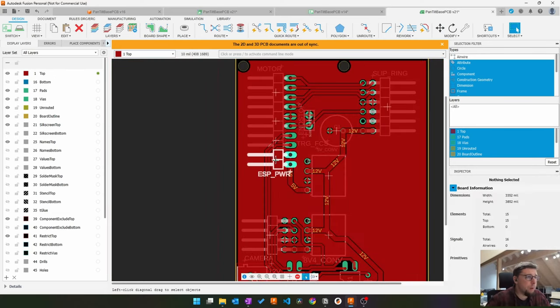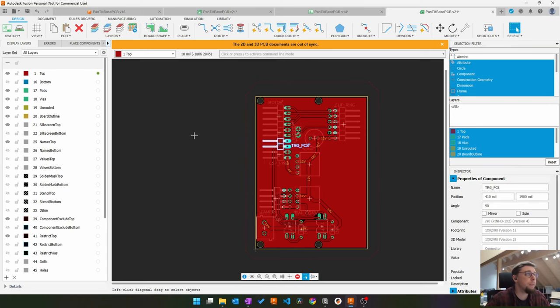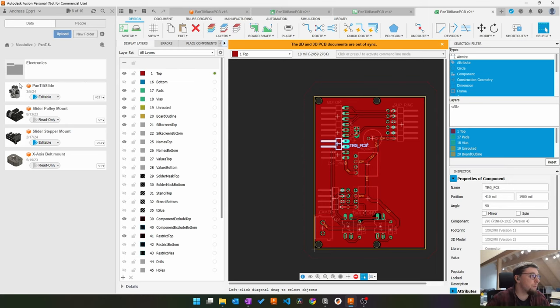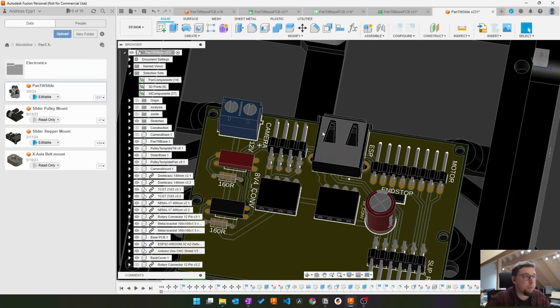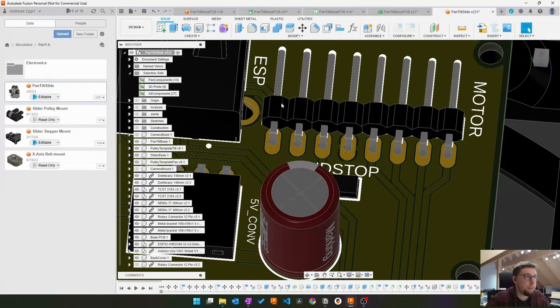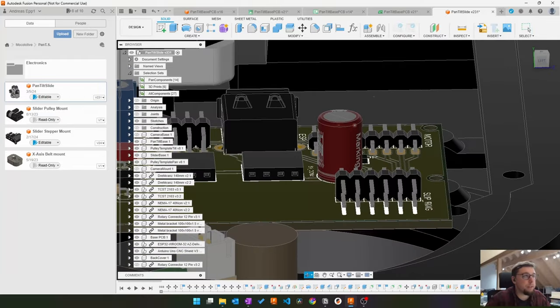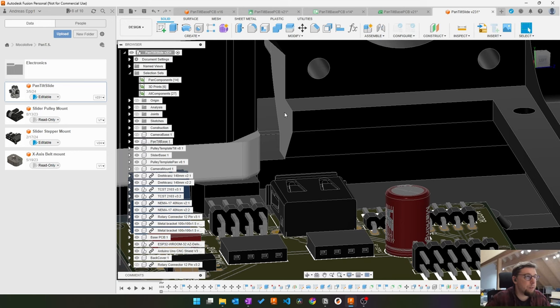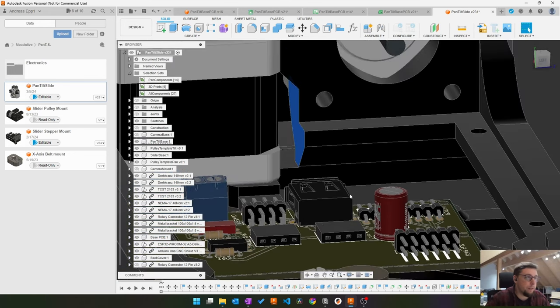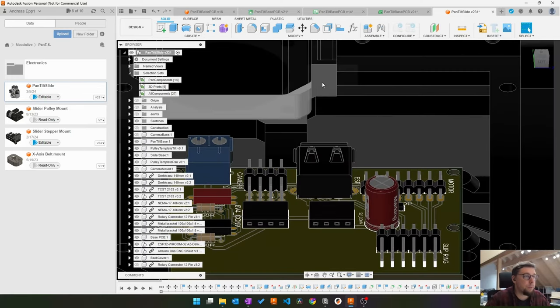Okay, so I've added a power connector here, but when I assembled the thing, I felt that these are a bit too far, well, left from my perspective, so up here. I want to get them down to here because that's about where the cables come out. I can show you in the full 3D view. So, that's where the USB used to be. And that's a big plug for the camera signals. Over here is the ESP connection, so trigger and focus. The end stop, which are those two, and then motor from the slider. And all this stuff has to bend around and come through here. You know, here. So you go straight, left, and straight. But because we lost the USB connector, I can pull them a bit more here so I can focus the cables through here. Okay, let me just do this.